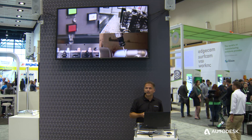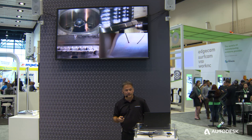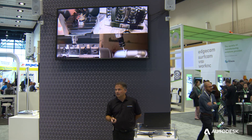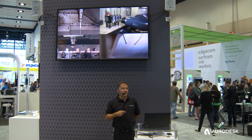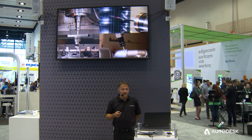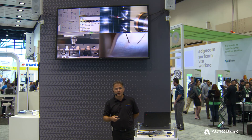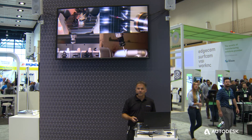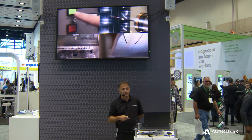So we can confirm a hole is being drilled to a specific size, and if not, take steps to fix the problem. But as part shape complexity becomes more organic, these canned cycles on CNC machine tools run out of steam — they don't provide the level of capability to allow you to measure those 3D shapes. And so with that in mind, there is a real place for dedicated metrology software products.